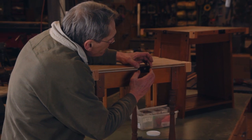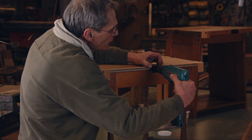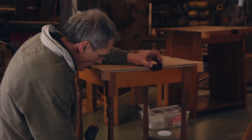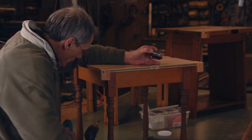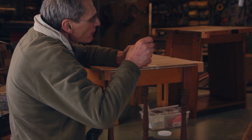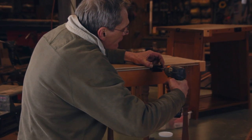I have my pre-drilled, pilot-drilled keystone piece ready. I hold it on and give myself a little mark with my drill to know exactly where to do my pre-drilling, or I can use the awl to press a mark into the edge so I know exactly where to drill. Then I drill a pilot hole through, take the screw, get it started in my piece, put a dab of glue on the back, set it right over the spot, and drill it tight.